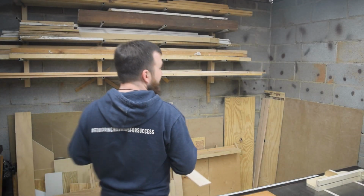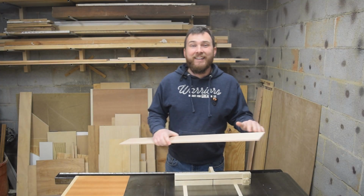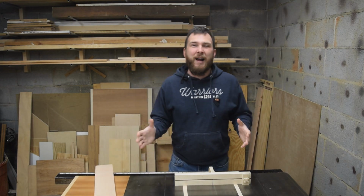The cards are 4 by 6 inches, so I'll cut the front and back at 6 1/8, and the sides maybe around 3 1/2. Making these crosscuts on the table saw is easy and accurate with my mini crosscut sled. I'll leave a link at the end of the video and also down in the description if you want to make one yourself.